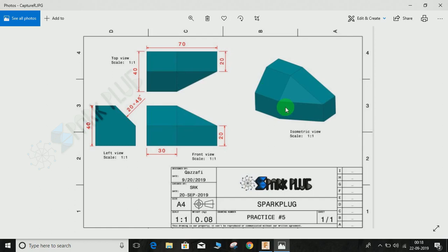You can find the high-resolution PDF of this 2D drawing in the description below. You can see it's actually engraved on a rectangular block whose dimensions we can see in the top view — 70mm in length and 40mm in width. The height is 40mm as you can see in the left or side view. We are going to make a block of 70 by 40 by 40 first, then do the cutting according to the drawing.